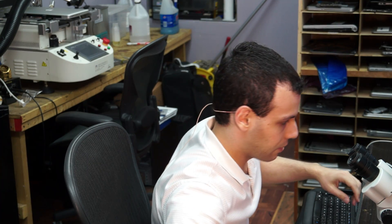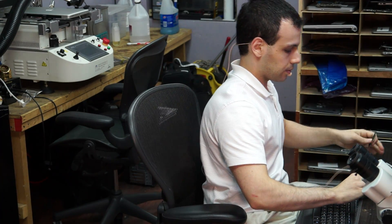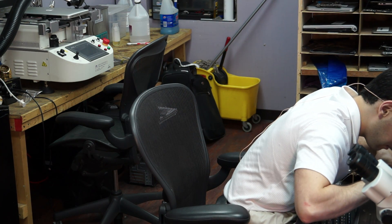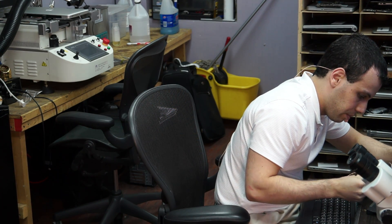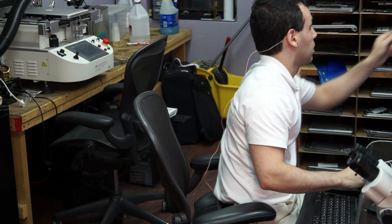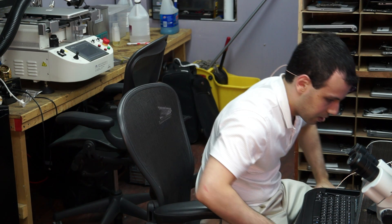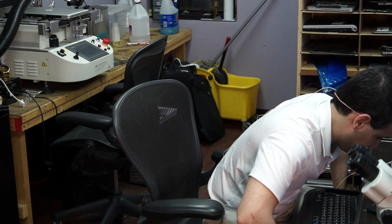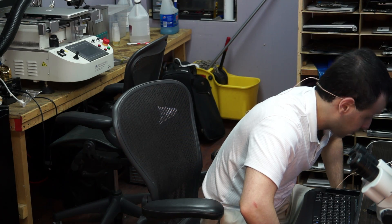Let's see if the rest of the machine works and if this thing will turn on. I'm going to put the RAM in, put a speaker on it, and a fan, then plug it in with the PP3V42 wire still in place. I get a green light and fan spin. But there's no chime.